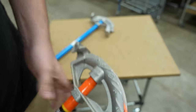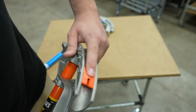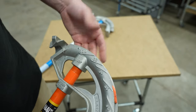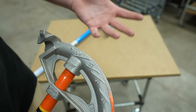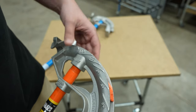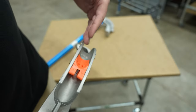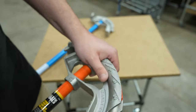So whenever you're bending, you just hit that hard stop and the conduit will sit flush in this channel and let you know that you're at 45 degrees. It's really helpful and useful to give you confidence in the angle you're bending, instead of trying to guess, adjust, stop, look, and keep doing that. This will actually get you a confident bend at the angle you desire.